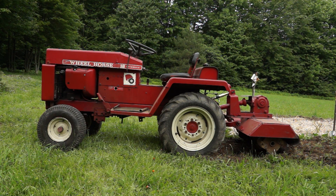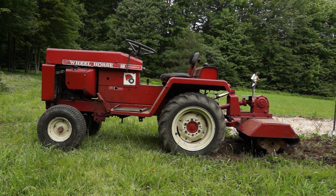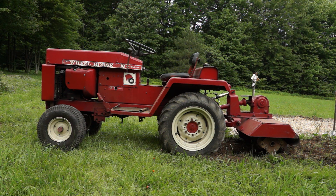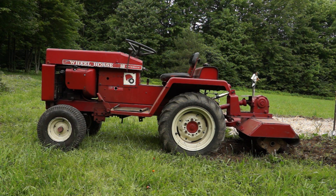As you can see, it works. We need to get a new PTO coupler now — the ball bearings came out of it, or we need to get ball bearings and put them back in. But we're taking this off anyway; this is mostly just a test. The clutch test was much more rigorous than mowing will be.